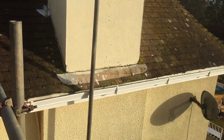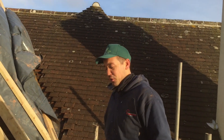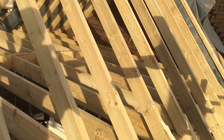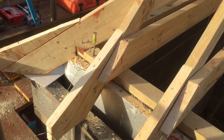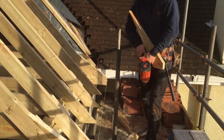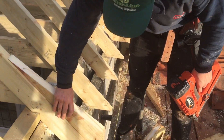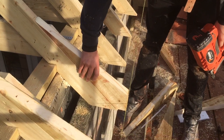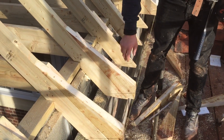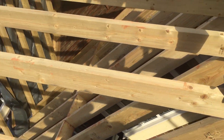What Callum's had to do is cut a shed load of these, because we've got to meet the existing. What I've done is come out 200 at the top, 200 down the bottom into the soffit — nice straight line through. Then as I'm going through, come down just touching the line like so, and we're putting a 150mm screw for it. So that creates that sprocketed detail.